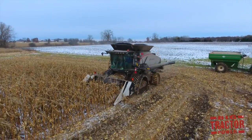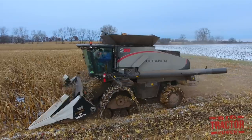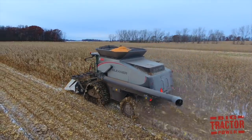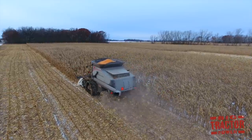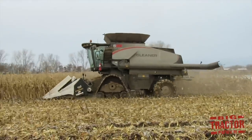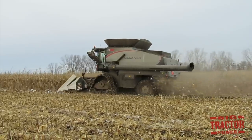The Gleaner S68 Combine was manufactured by AGCO at its Hesston, Kansas facility from 2014 through 2015. It's a Class 6 combine based on its horsepower rating, powered by an 8.4-liter twin-turbo six-cylinder AGCO Power engine, rated at 322 horsepower, with a maximum horsepower boost up to 398 in tough harvesting conditions. The combine in this video is equipped with a Harvestec Coronado 6030 6C 6-row 30-inch corn head.